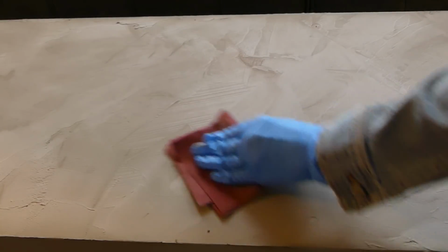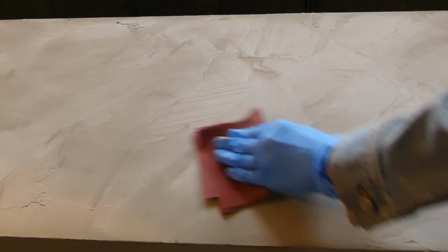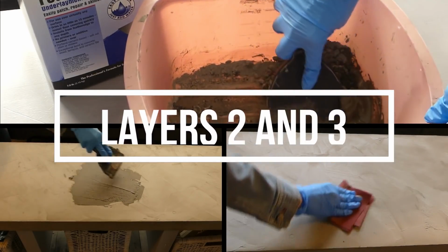The feather finish normally starts to set in 15 to 20 minutes and lightens as it dries. Clean your basin and scraper as soon as you finish your first coat, so the concrete doesn't harden. You've got a few more layers to go, and working around hardened concrete is a pain. Once the surface is fully dried and there are no dark spots left, lightly sand over with the sandpaper and clean up the dust. Follow the same process for layers 2 and 3.